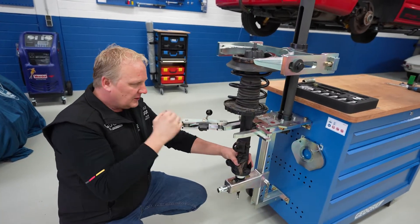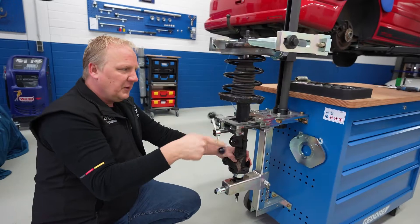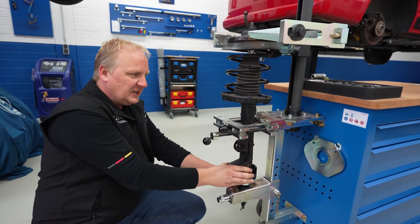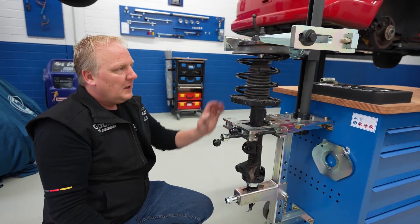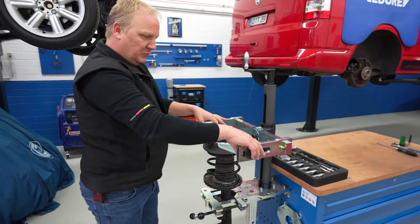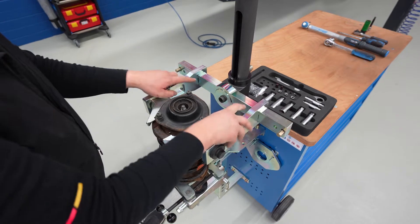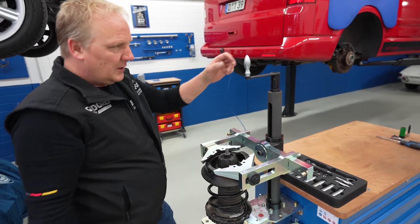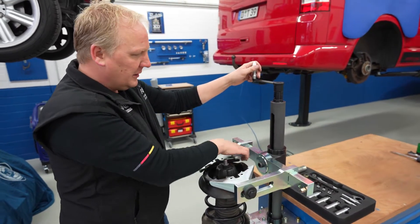An easy way to do it is with this machine. You lock it into place, not firmly, just like this. Make sure that it's tension-free mounted in the machine, up straight like this. Once positioned, we go to the top jaws. You just slide them into place and make sure that it's symmetrical — you can see the symmetry on these four holes in the machine.